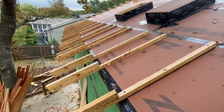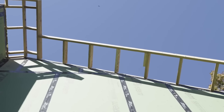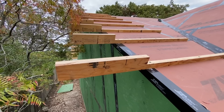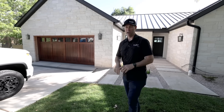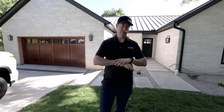When we framed the walls, the roof line went right down to the walls with no overhangs, and we built the overhangs later on top of the roof. That allows me to get a perfect air seal — which by the way also seals for bugs really well — from the foundation all the way to the ridge of the house. The attic is a conditioned attic, and I've got really, really good insulation around the house.